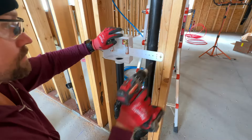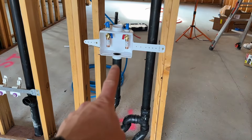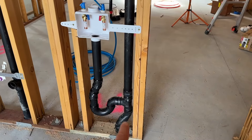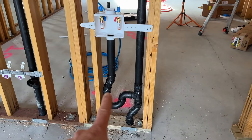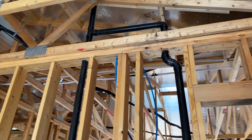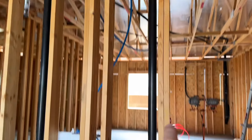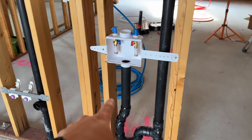There we go — we have our washing machine box installed. We have everything lined up, we have a minimum of a 24-inch drop with a little jog right there, we have our P-trap all cemented in, and you can see I moved my vent pipe over. We have all these joints and everything is really soft bends so that we can establish good water flow. Vent pipes are all secured, everything has a good slope so that if water ever gets into the vent pipe from the roof it can find its way back out through the sewer.